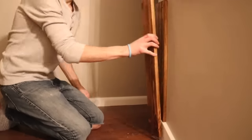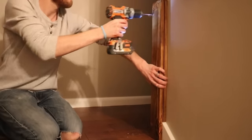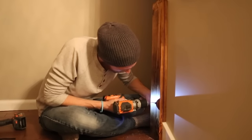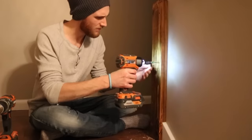My original plan was to add another 1x4 on the opposite side of the gate and attach it to the stair rail for the hardware, but it just didn't really work out. I couldn't find a good way to attach it, so I ended up putting this board on top of my first board and attached it with three-inch screws into that board.